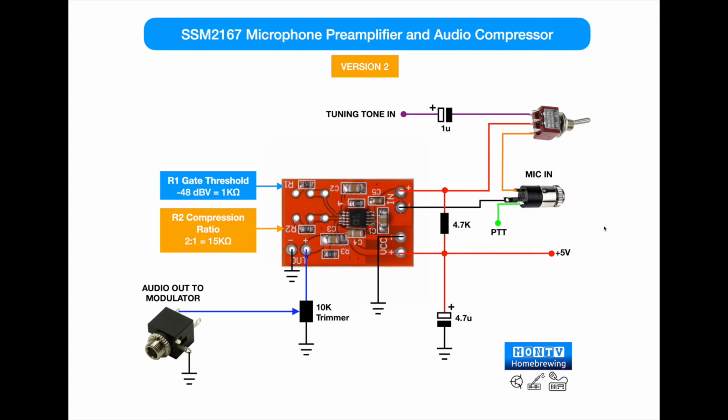The only other thing to mention is the 10K trimmer that you'll see there, and that just controls how powerful your output from the amplifier is. So it's effectively a gain control, and you can tweak that up and down depending on how much you want to feed into the balanced modulator. That will be trial and error really, and we'll perhaps see that a little bit more on the next video when we do some transmission tests.